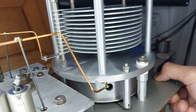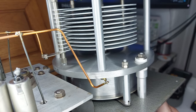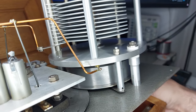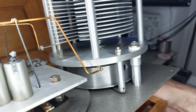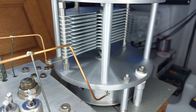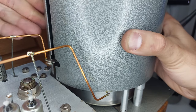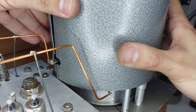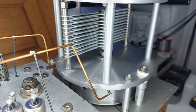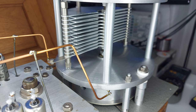Okay, so it's just one of these regular capacitors with the half disc plates, and as I said, when they're fully meshed, they have the highest capacitance, and when they're open, there's nothing. So, there's a couple of screws. Let me explain. This was like this, and there's a couple of screws down there, and a couple of screws up here, you can't see them. But in order to take apart this shield, you need to take out the screws down there. And I did that with an extra long screwdriver and a universal joint at the end.